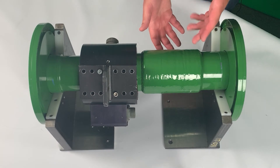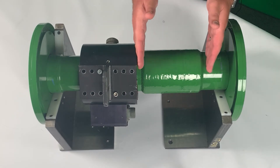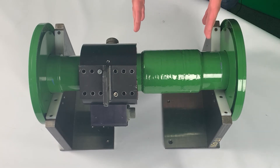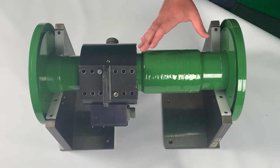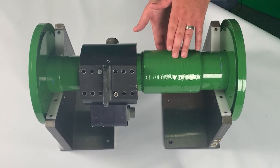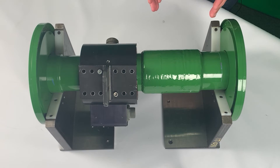Now that you have a better appreciation for the flow of information from the coupling, let's look at some of the components closer. On this coupling, you will see the fiberglass tape installed on the coupling spacer tube. Normally we need about six inches of space on the coupling tube. The fiberglass protects the copper wires installed underneath the tape, and those copper wires act as a transformer to power the strain gauges installed on the inside of the tube.